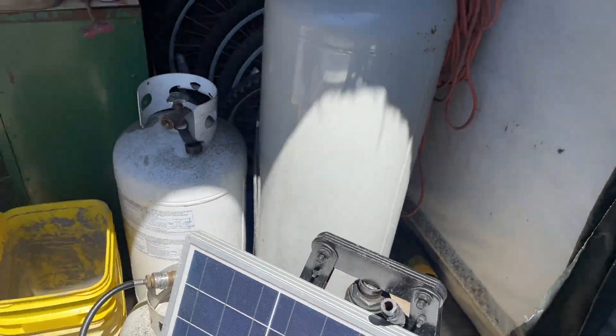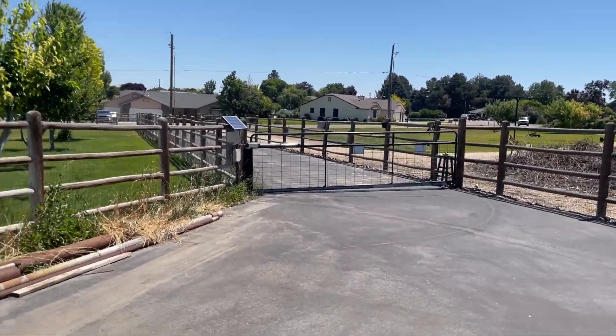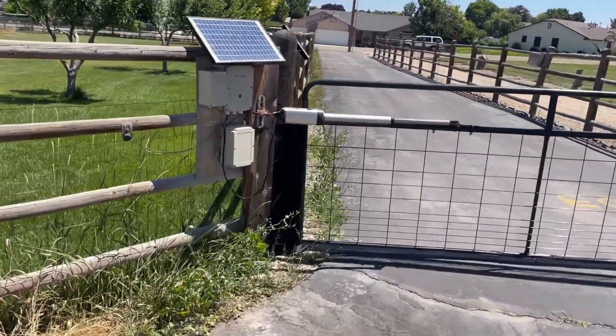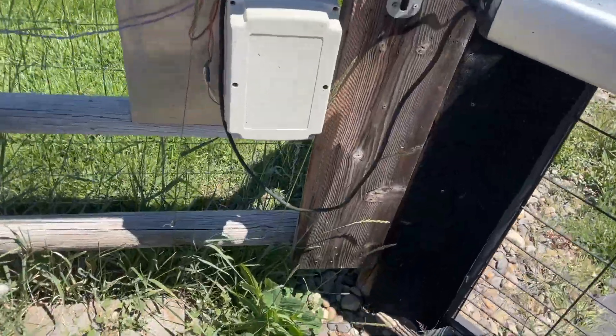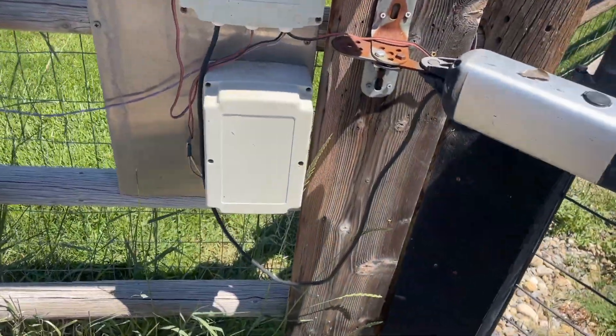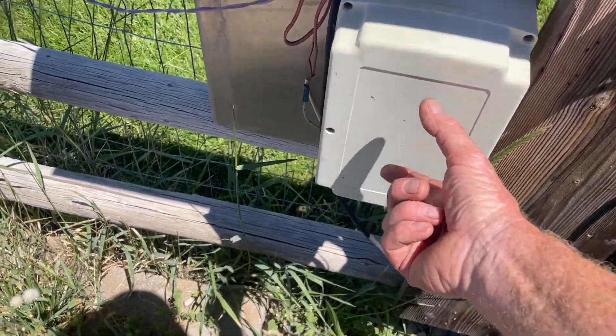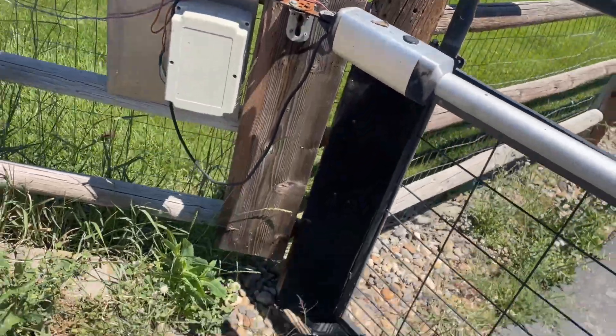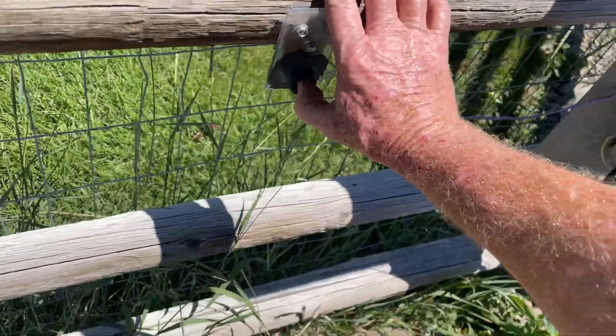Anyway, I like those point-of-use ones — very handy for me. Now, I first started out doing solar in my driveway, which is out here. It's a point-of-use job again. I bought the little actuator gate opener gizmo there, and it came with a solar panel and some lead-acid batteries, which have died a few years back. Then I got some lithium iron phosphates in there — two of them. It charges them up really good, and I added an extra panel just so it had a little more juice. It works really great and has been working for a long time.